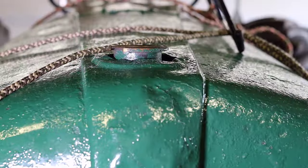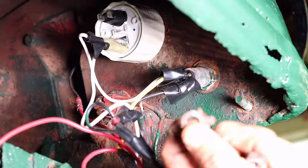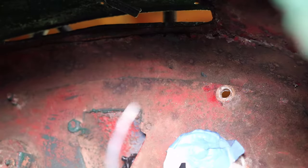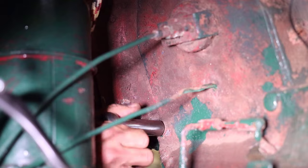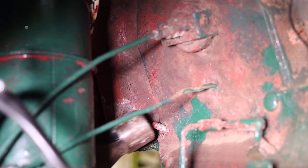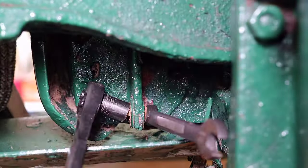I removed the radiator cap and covered it with tape. The rear of the hood mounts as though it wraps over the top and sides of the instrument panel. I then took out the fasteners for the four carriage bolts that hold the hood to the instrument panel. Not only do the four fasteners have to be removed, but the rear of the hood must be lifted over the top of the instrument panel. The fasteners required a little bit of effort but they did come out with hand tools. Next were the fasteners holding the lower part of the hood assembly and grill to the radiator mount.